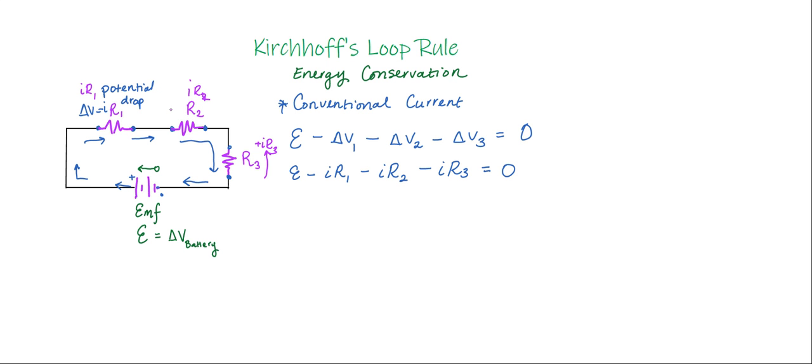So we have to keep in mind that when you're moving in the direction of the conventional current, in this direction over here, I'm going to have a potential drop, and when I move against the conventional current, I'm going to have a potential increase. So what the loop rule does is essentially write out this full statement and show that the energy is conserved all the way through. What this would allow us to do is solve for a variety of different things. And we're going to see how that's going to pair with Kirchhoff's junction rule in the next video in order to help us analyze more complex circuits.